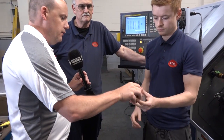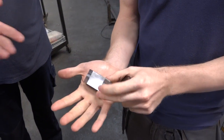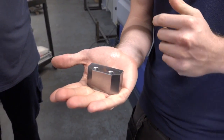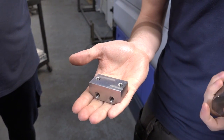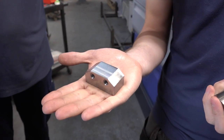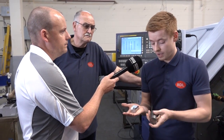So you've got total flexibility. Now Lewis, this particular part here is made out of bar — can you tell us about it, because it really emphasizes the machine's power and capability? It's a support block. We made it from 38mm round bar; we milled it on every side. Most engineers would think it was a milled part — it's actually made on a sliding head machine. It's EN16T, so it's a heavy duty, high tensile material. Doing it on the ST38 gave us the ability to machine it through the night, which made it extremely competitive. It's around four minutes to make that from round bar — complete off the sliding head, without a man standing there.